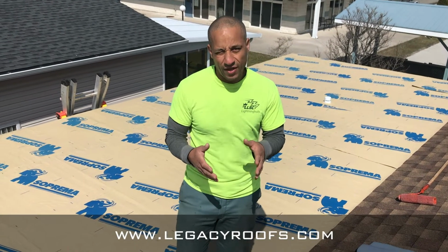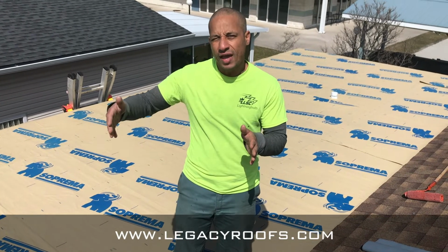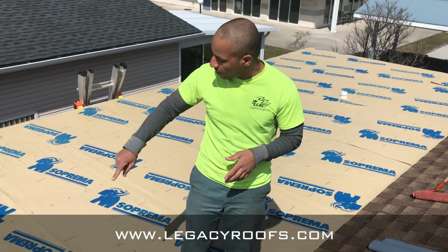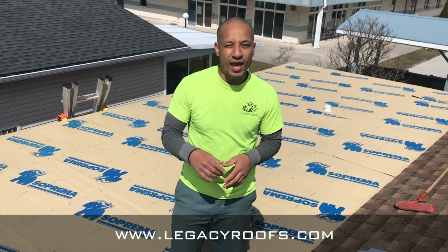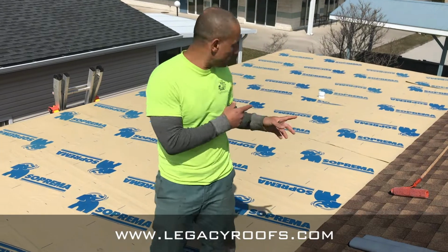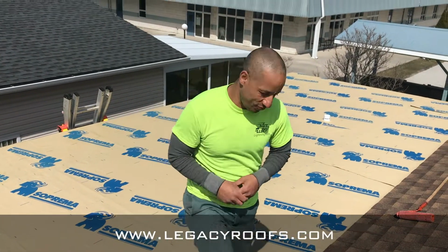Metal is tough on a flat roof because it's multiple panels with caulking and seams between. So anyway, base sheets down. We got to put drip flashing around the outside, and then we have to prime it, cap sheet, weld. We got a wall detail we got to show, and we'll show you what it looks like. We're well on our way. See you soon.